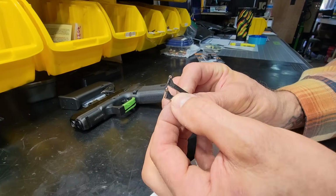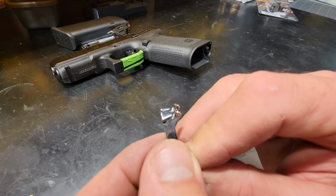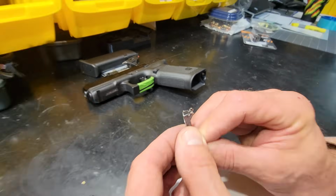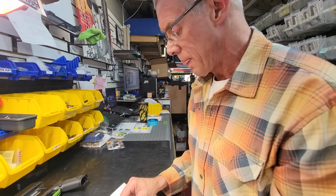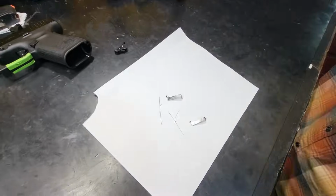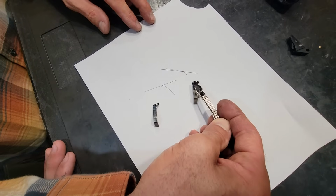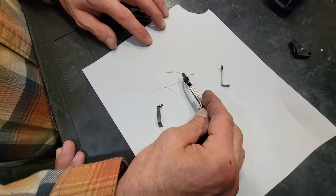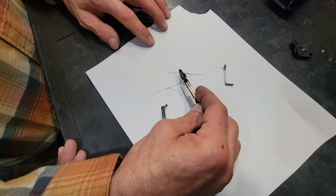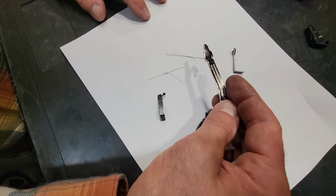So I'm going to put one underneath the other so you can see the difference in the angles is very, very profound. Okay, I think it's almost like a 13-degree difference. So if I would set these here correspondingly to show you what's going on with these angles and how they work the way they work, when this trigger bar comes and hits that angle, let's say it this way because it's easier to draw, it goes down in a very obtuse way. So it hits it and there's no wall, because it's very sloped. You know, it's called an obtuse angle. So it hits it and goes like that. You don't have much resistance.